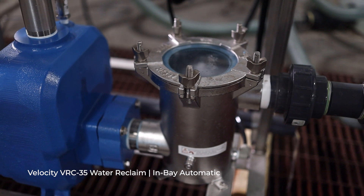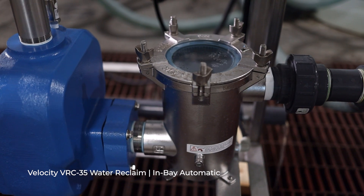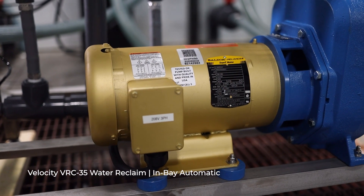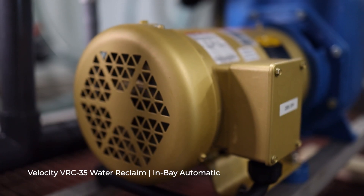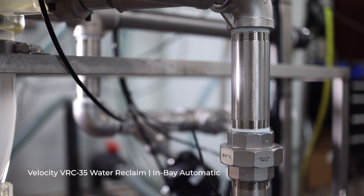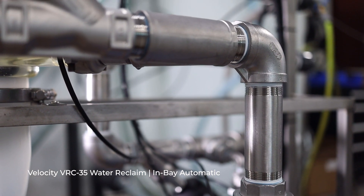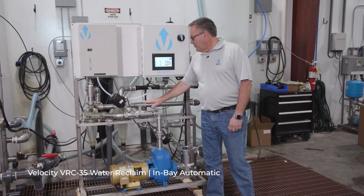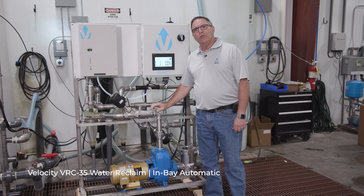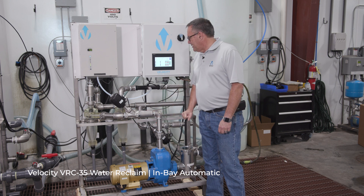The unit comes with a stainless steel strainer basket, high-efficiency pump, high-efficiency motor, totally enclosed fan-cooled — so that you can spray it down. All the piping is stainless steel, with breakaway unions, breakaway couplings, low-friction elbows, Ys and 45s to give you constant water flow at low loss and low turbulence.